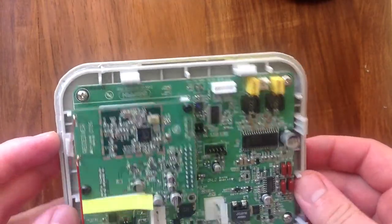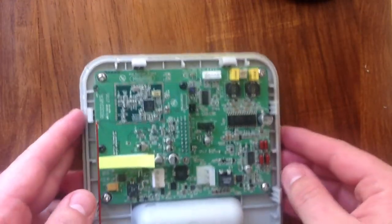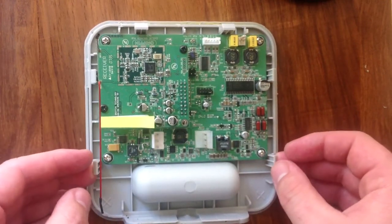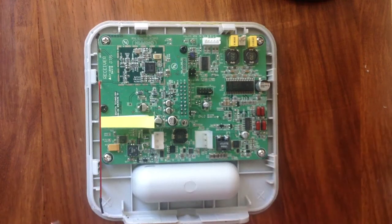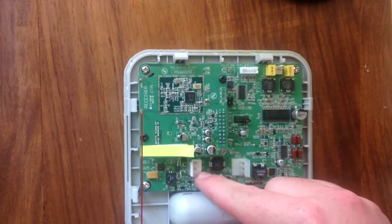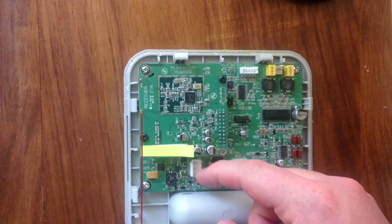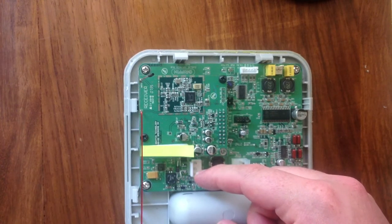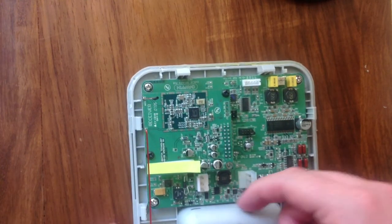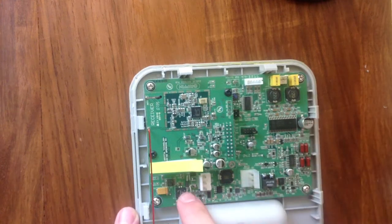After I got this thing open I looked around. There wasn't anything obviously dead or blown or had its magic smoke liberated. So I took out a good old multimeter and started probing around. I found with the continuity setting that basically the two ports connecting positive 12 volts and ground were essentially shorted - there was maybe a 1.2 ohm resistance on it, but it was a short. So I looked around for what component after the plug it might be, and I found it was actually this diode.